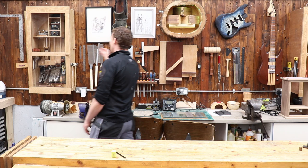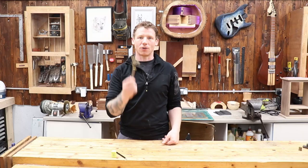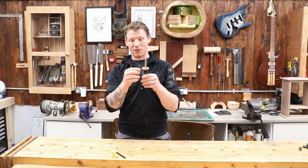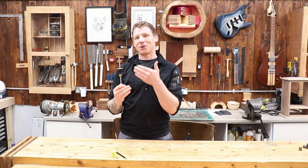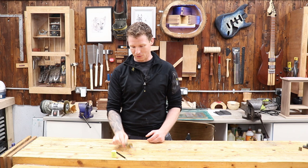Next up, we want a marking gauge. There are loads of different types on the market. I recommend the wheel type with a cutter wheel — you can go across the grain and with the grain. This one is made by Veritas, but Quangsheng and other companies make ones just as good and less expensive. Or you can go with the wooden block type, but get one with a pin and a blade — a pin for going with the grain, a blade for cutting across it. Could you get away without a marking gauge? You could use a ruler and pencil, but I think it's an absolute essential.